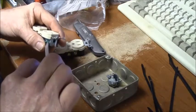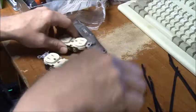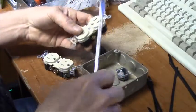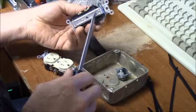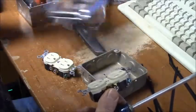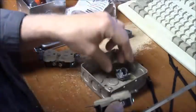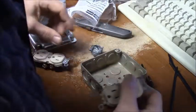I'm not going to hook up a pigtail to these outlets. Well, yes, I am. I'm not going to hook a ground wire to the box, which won't be according to code, but because the grounds will be attached to the frame of the outlet, which is going to be screwed with three screws to the lid, and the lid's going to be screwed to the box, everything's going to be grounded. I just couldn't find a stupid little ground screw, so